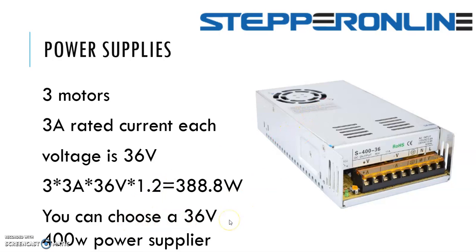If you're running a setup where you have one power supply per driver, you absolutely want to make sure you have sufficient margin. If you use a switching power supply and run out of power — a brownout — your driver can do really erratic things and make your life frustrating. There's the rule of thumb for voltage and wattage on your power supplies.